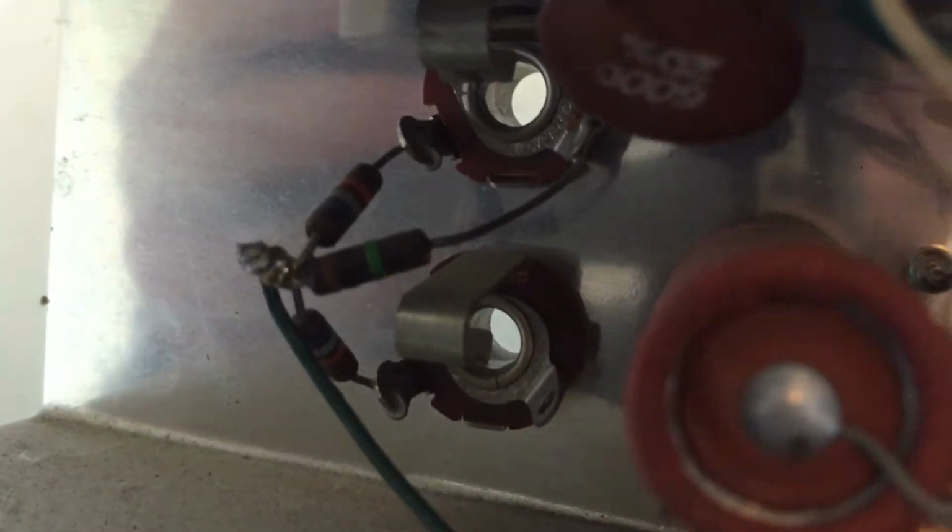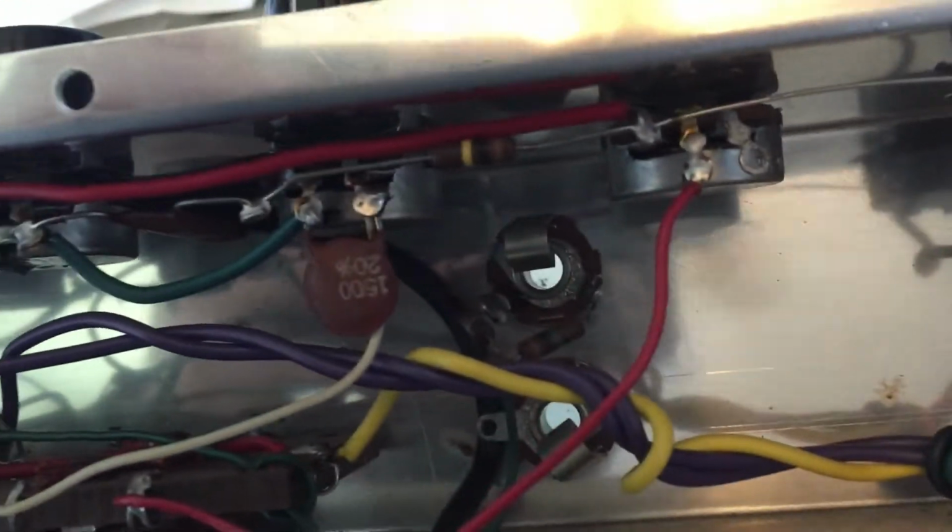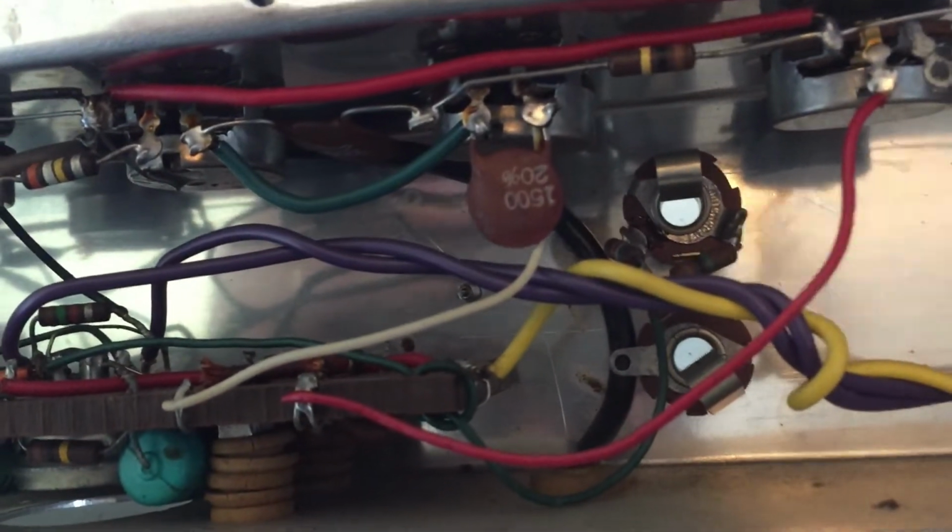And I find that as I look at the resistors, the channel 2 inputs are balanced. The channel 1 inputs are not balanced. They have a slightly different configuration on the second input of channel 1. So there's something going on there. Perhaps that's a guitar microphone combination that may be in play. Regardless of what's going on there, maybe it's a different pickup combination.